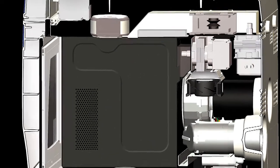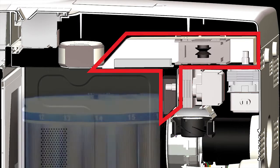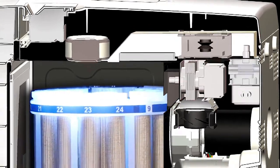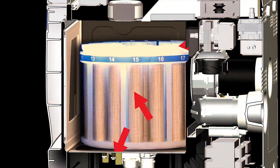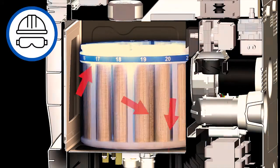To further ensure rapid heating, the MARS-6 has a built-in waveguide that evenly distributes the microwave energy over the vessels. So even though the reaction vessels are independent of one another, they all receive the same amount of energy, which is key for ensuring accuracy, reproducibility, and safety.